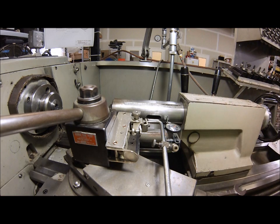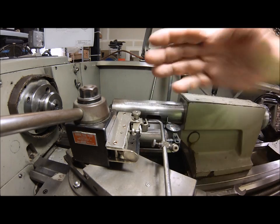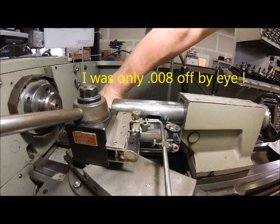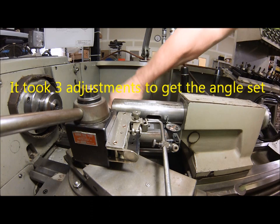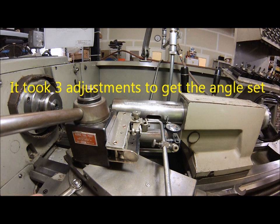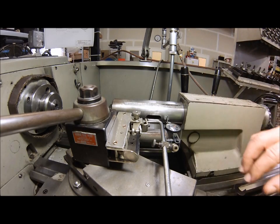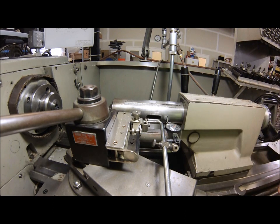When you have the three-inch, 1.561 measurement — or whatever measurement you're shooting for — and you have a zero-zero on the three-inch leg, snug up your compound. Make sure nothing moves, then repeat the process one time to make sure everything is as it was. Zero-zero, three inches — you've got the most accurate angle you could possibly set, already dialed in. Piece of cake.